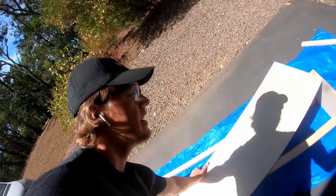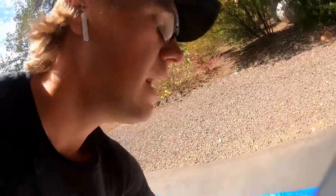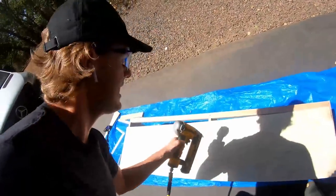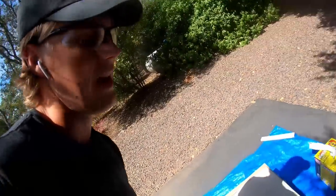To fasten the quarter-inch Baltic birch plywood onto the cabinet exoskeleton we're going to do two things: glue it down using the same wood glue we used for the slats, and then hit it with the brad nailer around all the locations where it contacts the cabinet. Between the brad nails and the wood glue, this should leave a very strong piece of work.